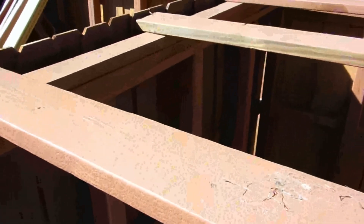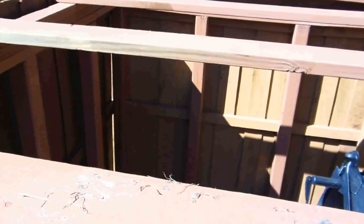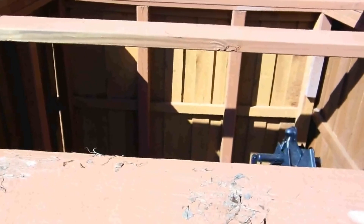I got the 2x6s nailed up in here — there are 3 big nails on each side, spaced 22 inches apart. I could put four 2x6s in here and make this solid wood if I wanted to, but I'm not going to, because this will hopefully be considered just a fence, braced against wind. I'm going to put a tarp over it — it's double the thickness of a super heavy duty tarp — and I've got one more board to put in here.